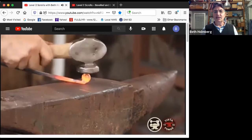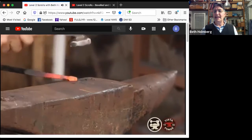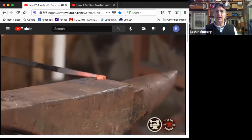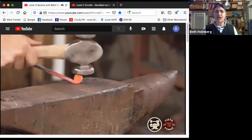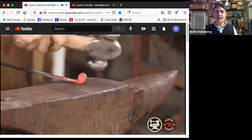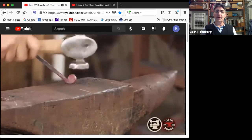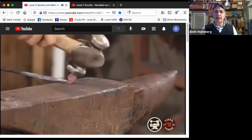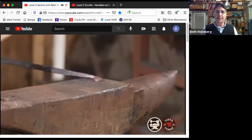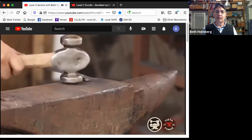And then I got to look at the shape. It's a little bit of a grape still, but I'm trying to make it round. I don't want to end up with a kiwi. I want to actually have it be round. A cherry, not a kiwi. Make sure the thickness is evened out so I can tell what's actually going on. So I'm doing a lot of looking and fixing. Again, very deliberate blows, all of them. Making sure I've got it brought up there a little bit. Flattening it with only the finial on the anvil.